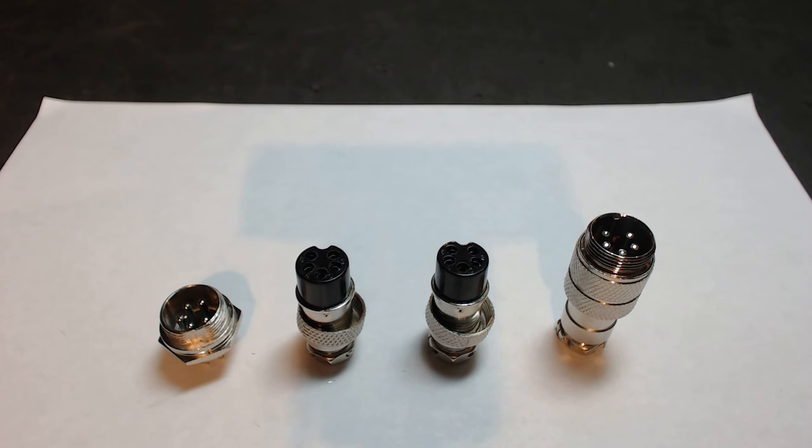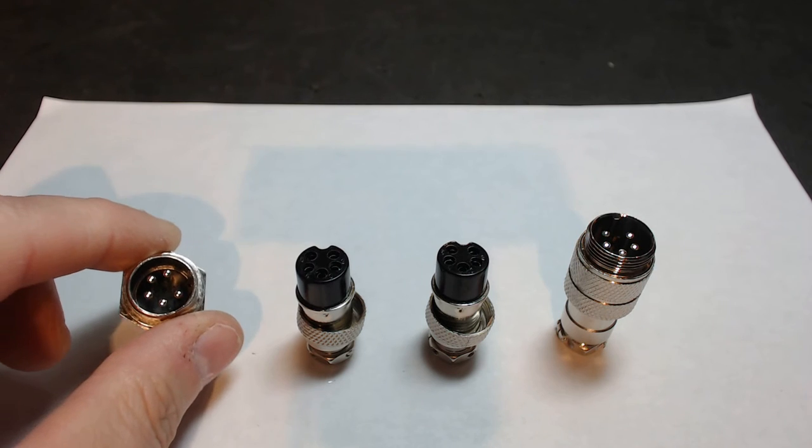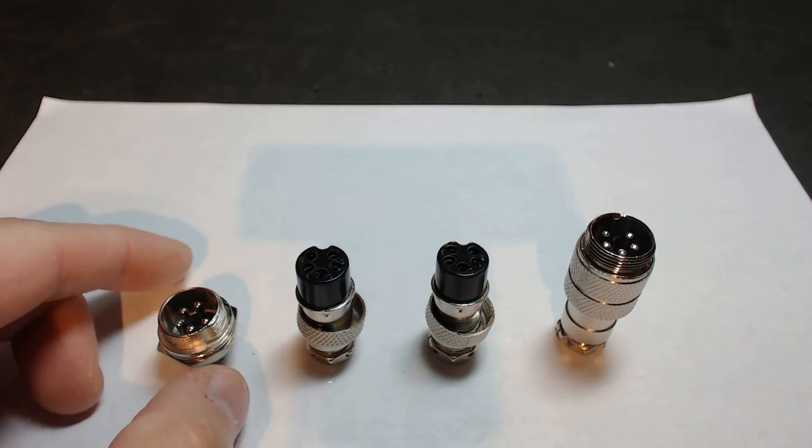If I'm doing a pro-grade build or a retrofit where I want to step it up, or I'm dealing with higher amperage — commercial grade, Gecko G203Vs, Gecko G201X, Gecko G214s, where you're going in excess of 70 volts — these are your connectors of choice, or at least my choice.